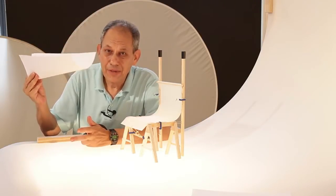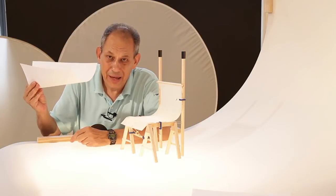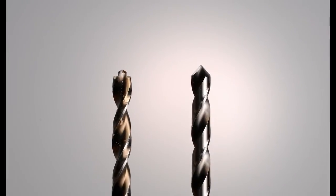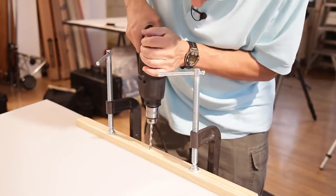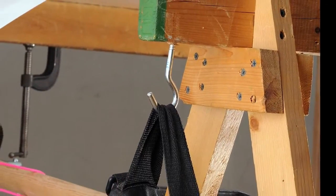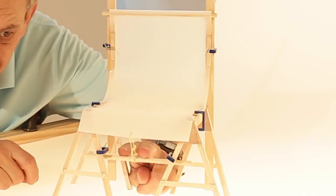It can support more weight, it can be used for more things, and I'll show you another reason why we want to flex the front of the plexiglass light table downwards. You'll need to drill a hole through it to attach a rope. If you don't have a special plastic drill bit, you can clamp two pieces of wood, one to each side of the plexiglass, and drill through the plexi-wood sandwich — it will stop the plexi from cracking. Notice we've added hooks to the sawhorses and hung sandbags from them. In the next step, we're going to flex this front edge of the plexiglass table to get rid of the bow in the middle so we have a flat, stronger work surface.